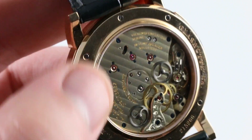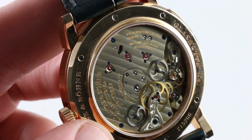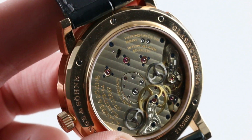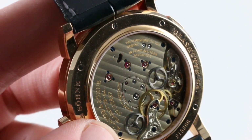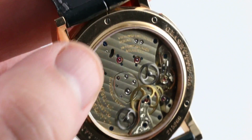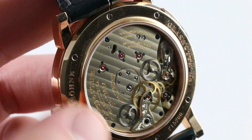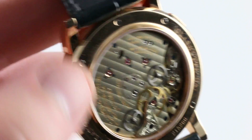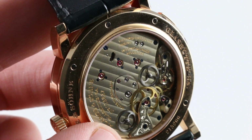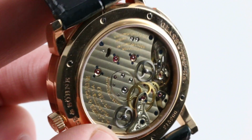The watch features all of the conventions of German watch finish, most of which in the modern era were pioneered by Lange, a company revived with a historic name in 1990 after the Berlin Wall fell. The conventions include a large 3/4 plate over the drivetrain and the barrels in the fashion of an old Saxon pocket watch, Glashütte stripes. We are not in Switzerland, these are not Côtes de Genève. You'll also note an untreated German silver compound used to make the bridges and the plates. Now it's not silver, and what it really is to achieve that golden glow is principally nickel, copper, and zinc, with copper imparting that golden hue. The reason it's not like a silvered Swiss movement is because those are generally brass that's been rhodium plated for corrosion resistance. German silver is inherently corrosion resistant, so it needs to not be plated.